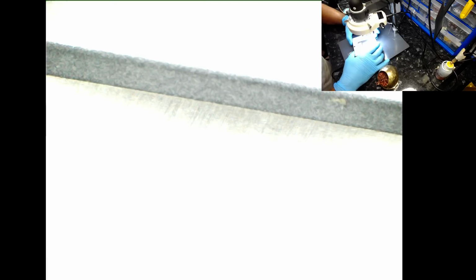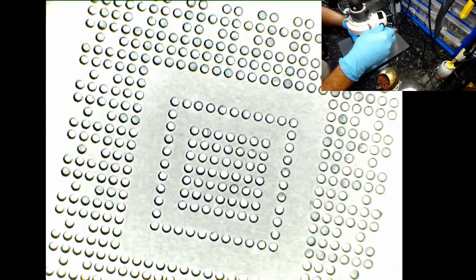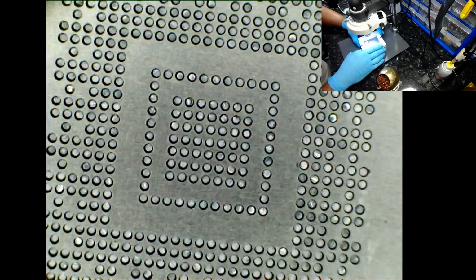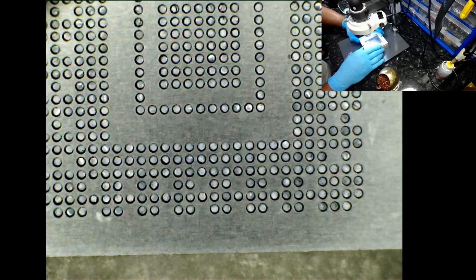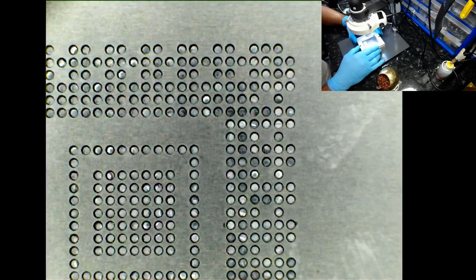Sorry, didn't see that. Reduce the light. That will completely turn the thing off. Okay, I think that's much better. So yep, as you can see the stencil is lined up. Okay, I'm happy with that. So I'll tighten the screws now. The Allen key screws, there's 4 screws on the actual jig itself, just to hold the stencil in place. Okay.